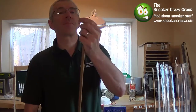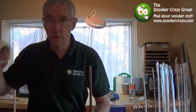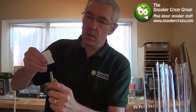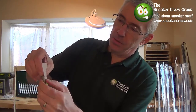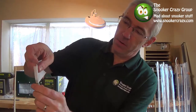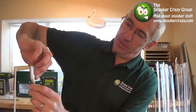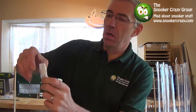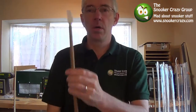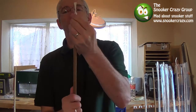This is going to be the more difficult of the two. Now what I'd normally do, if that had a ferrule on it, I would get some masking tape and just go around the brass. Because as you're going up and down, if you damage your ferrule, especially with the grits of sandpaper we're going to use, you're going to be in a bit of trouble. It'll take you ages to put it right if you do that. Make sure it's something you can put up and down.